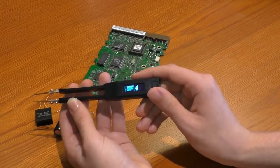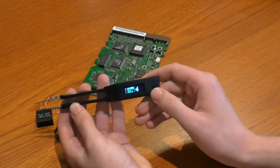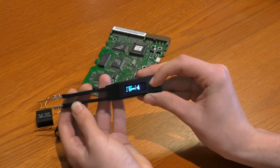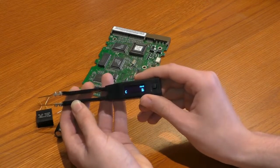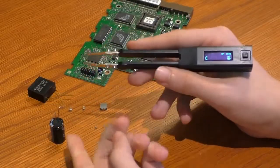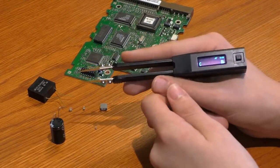In order to put the device in C mode, select Measure, then Mode, and then CAP. So this can be done through the menu as well, but it is usually quicker to go through the quick controls. Now in C mode, we can measure this capacitor. Decrease frequency to 100 Hz, and in this mode the device produces very stable measurements.